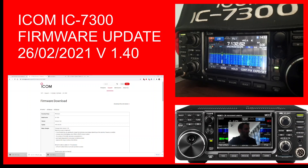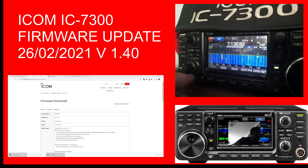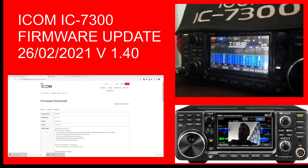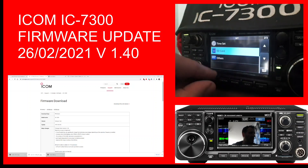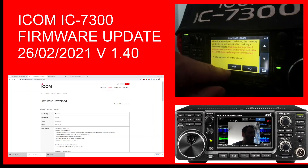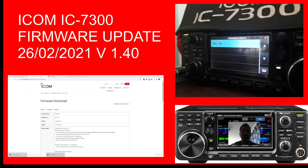We've pasted it onto the SD card. I'm just going to put the SD card in the radio now. I know it's a bit dark but you get the idea. Go Menu > Set > SD Card > Firmware Update, you get the warning, click yes, and if you put the file in the SD card and slide it up to the top bit that says 7300, it will show up.